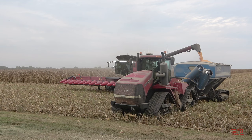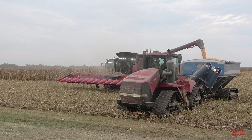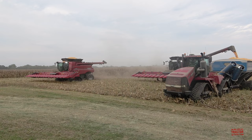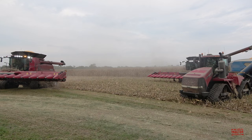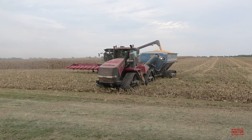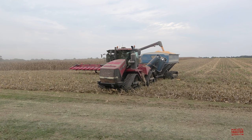It's manufactured in Grand Island, Nebraska. It's a Class 9 machine based on its horsepower rating of 550. The Combine is equipped with a CVT 30-inch diameter rotor for threshing. The Combine is fitted with a 410 bushel grain tank and is rated to harvest corn up to 5,000 bushels an hour. It's equipped with a 28.9-foot unloading auger that unloads at a rate of 4.5 bushels per second.